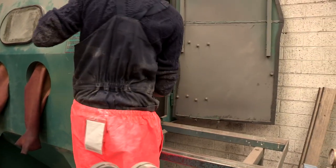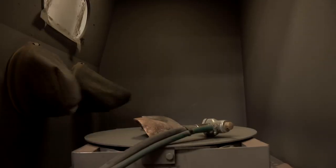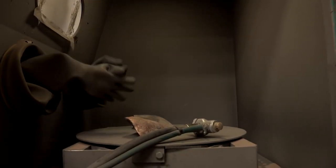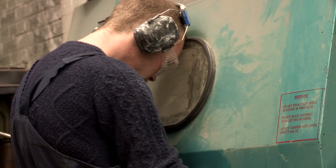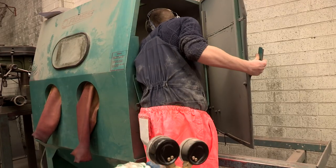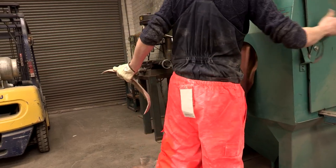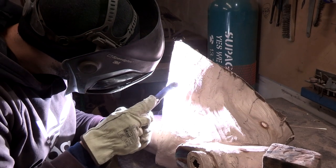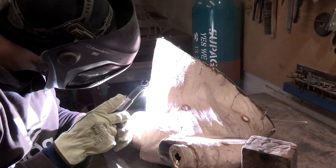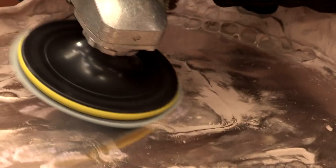After the removal of excess metal, the piece is blasted with high pressure sand. This cleans the piece and removes any casting marks. Nail holes are welded up, rough edges are ground down and, depending on the size of the piece, it may need to be welded together. Pneumatic tools are used to get rid of imperfections known as flashing and to buff the metal.